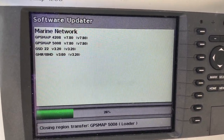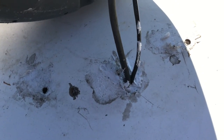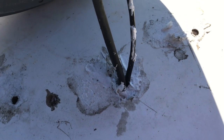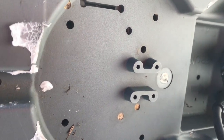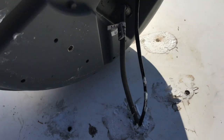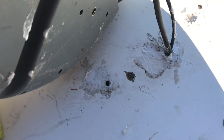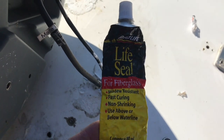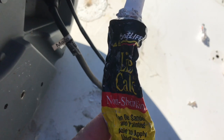After this loads up, the customer will be good to go. Before I set this unit back down permanently, I'm going to redo this silicone job — it was really poorly done. You really should use a rubber grommet when you're going through a hard top; it helps with wire chafing. Also there is a piece missing here that keeps the wires in place and takes some strain off them, so I'll put one of those on too. You shouldn't let just the average guy install your radar — it's a pretty important component. I'll seal the bolt holes back up as well. I suggest LifeSeal by Boat Life — best stuff. You can get the LifeSeal or the LifeCaulk; I use the LifeSeal a lot.